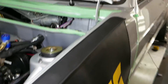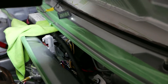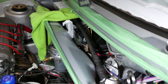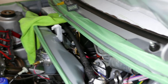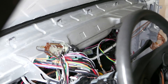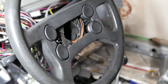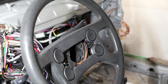The line from the TXV all the way across the beginning of the evaporator — everything in this whole area gets nice and cold. I'll probably have to insulate the inside of this so that engine heat doesn't go through that metal surface. On any Mark 1 or Mark 2, any heat transfer across is going to warm up the incoming air. I'm getting a 5°C differential from input to output on a medium blower setting. It's cold today — barely 21°C, about 70°F.